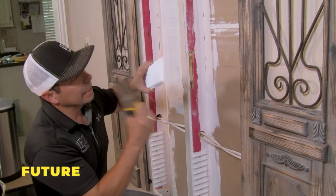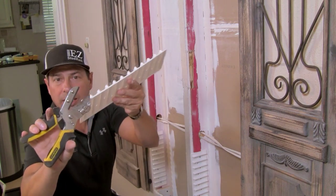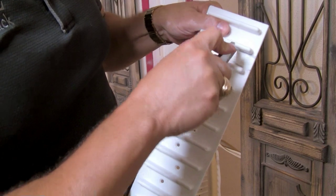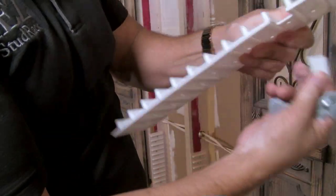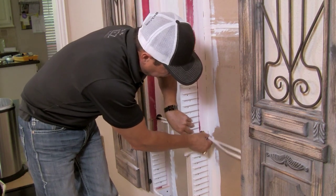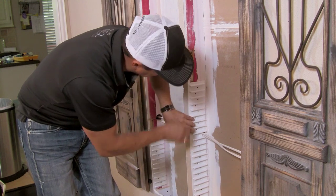You're probably thinking, how am I going to cut this little piece to fit around the electrical cord? I just measured it out. I've got a utility blade — I love these things. I take a regular knife and do a nice little slice right here deep enough to break the edge, then just snap it off. That's how easy it works. I put it up there and measured it to where it would fit. There's a lot of movement and flexibility there, so I got it to fit right in between the two boards. Then I go in and attach it like all the others.